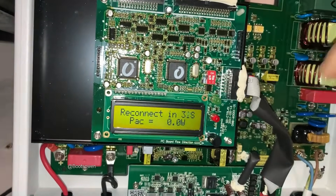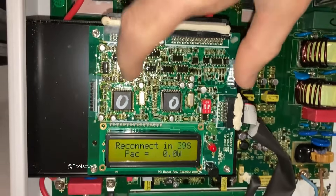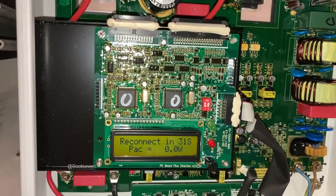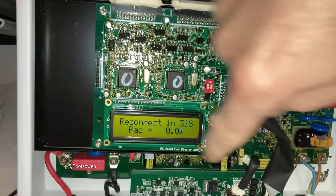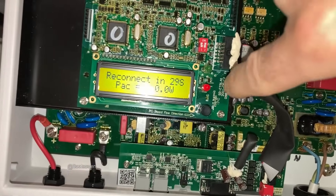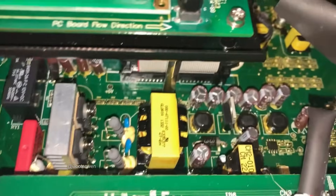She's gone back to zero and it'll reconnect, so I might get to see that relay again. Take off as many clips and things as you can — take photos if you want, in case you don't remember how to put it back together. Then there are three screws on this one, you pop this board away, and then there's a tower beneath it — this brass leg there — you have to unscrew that.